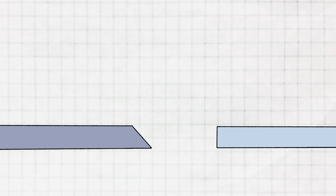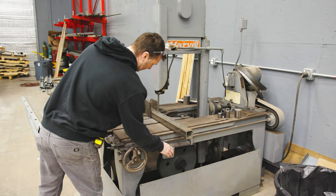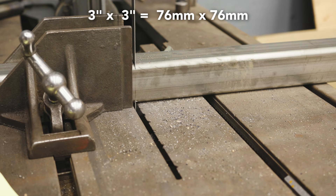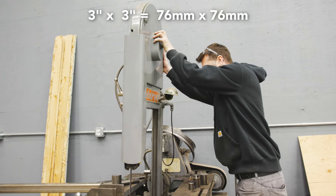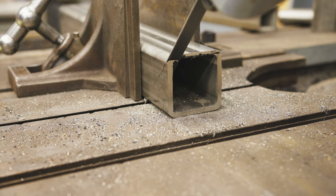To get started, I'm going to rob the feature from the trailer jack where it has two sliding components that go in and out. This makes up the main body of the whole jack — everything is going to be built off that. For the main body I'm going to be using 3x3 square tubing, and of course to keep it corrosion resistant I'm using stainless steel. This is going to add some major problems a little bit later on.